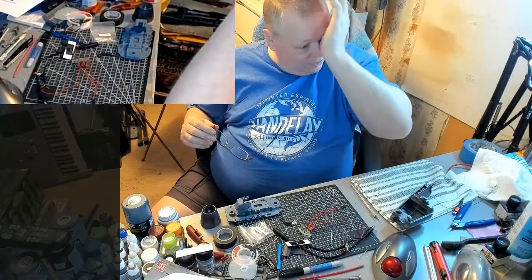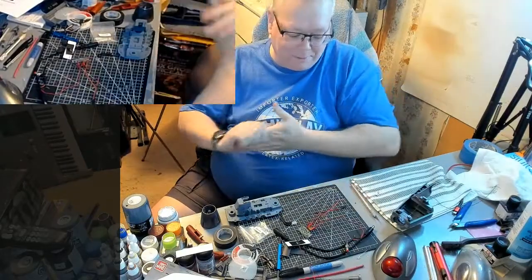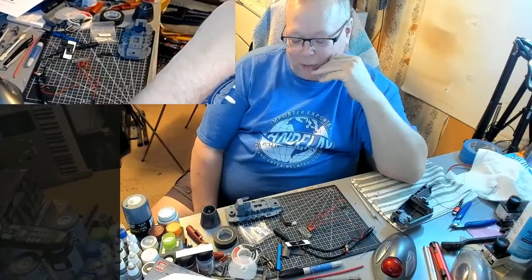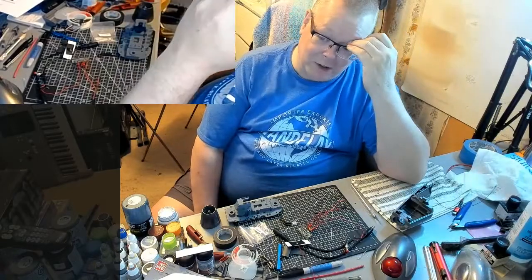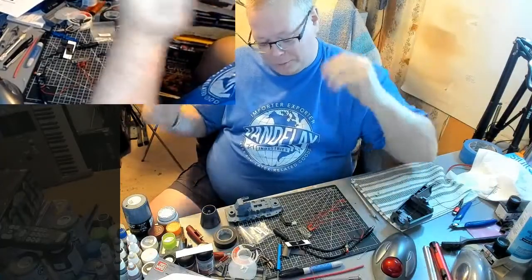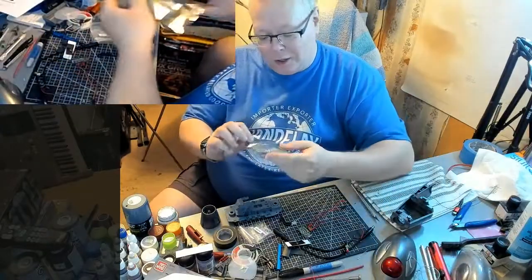So I actually sent an email off to Madman Lighting and asked them about it. And they said, if you're going to hook it up direct, you need to put a diode in between. So I burned out 3 LEDs, and I was like, crap, I'm not going to have enough white LEDs now. So I went on Amazon and I bought some LEDs, nice and cheap.